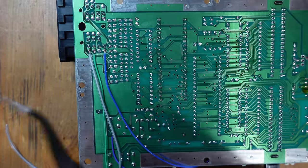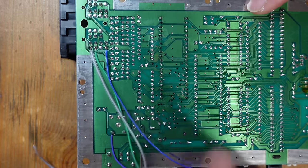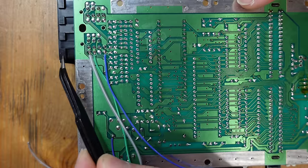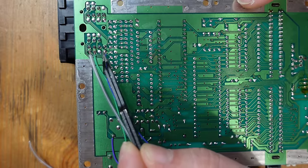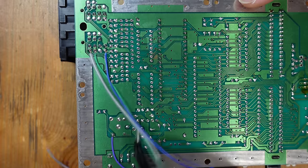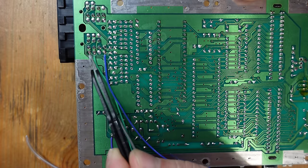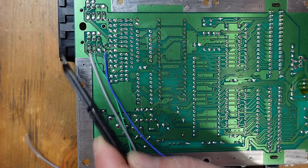And then we also have the board itself, and I've installed 4 wires on the underside. So you can see that 3 of them go over here to player 1, and you can see that I've attached them to these 3 pads right over here. And then finally I have this purple wire here, and this is tied to the reset button. This is actually physically where the reset button is located. So these 3 wires are connected to the clock, latch, and the data lines on player 1.